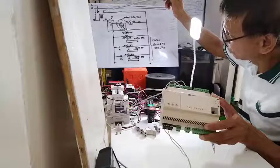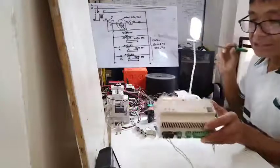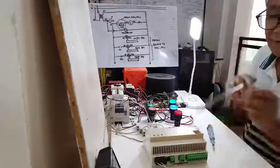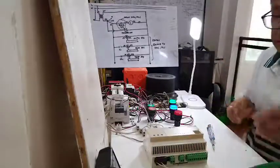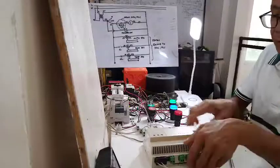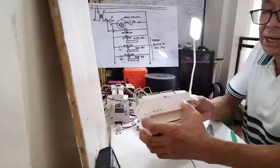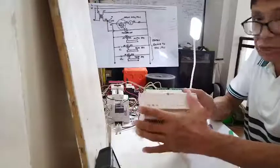When my DDC relay's normally open contact closes, 24 volts will be fed to A1 of my contactor, and A2 is connected to 0 volts. The circuit is complete and it will start this fan. This is how you connect this simple motor to a DDC or controller.